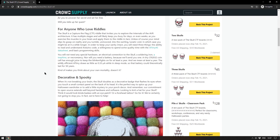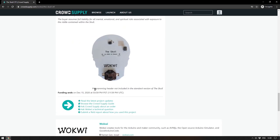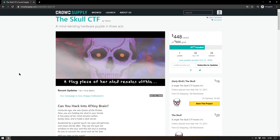There isn't much information about the puzzle, but the useful bits are: you need the ability to read and understand Arduino code, a willingness to spend some quality time with the AT45 datasheet, and some basic programming skills. There is a programming header on the back though it's not included in the standard version. This is very open hardware, so even if you didn't solve the puzzle, you have a stylish ATtiny board you can use to learn to program ATtiny45 chips — a very good next step on from standard Arduino boards, as ATtiny chips are from the same family as the ATmega328p on Arduino UNOs.